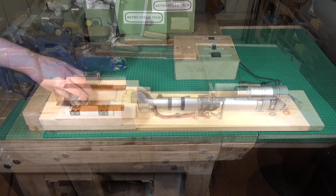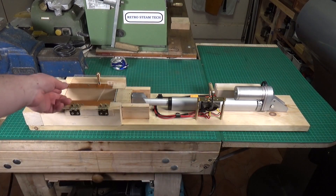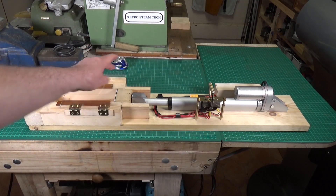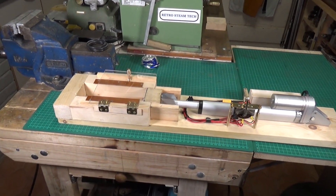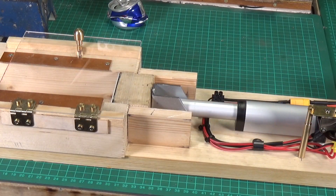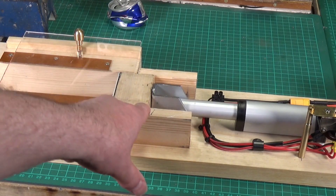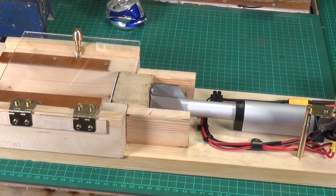So the can crusher is now finished and ready to go on the wall. I've added a few refinements since you last saw it. I found that every now and again a can would pop out of the slot while being crushed, so I've added a perspex door which stops that from happening — and obviously as it's going to be mounted vertically against the wall, that's more likely to happen. I've also extended the channel slightly so the ram can go all the way up to its limit stop and still be in line with the main channel. I've added a metal plate to the end of the wooden ram to protect the wood, as it would get dinged up over time.